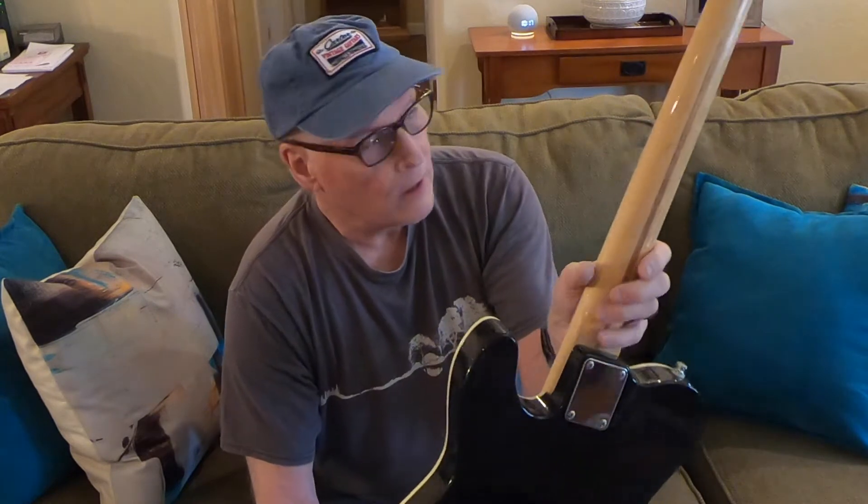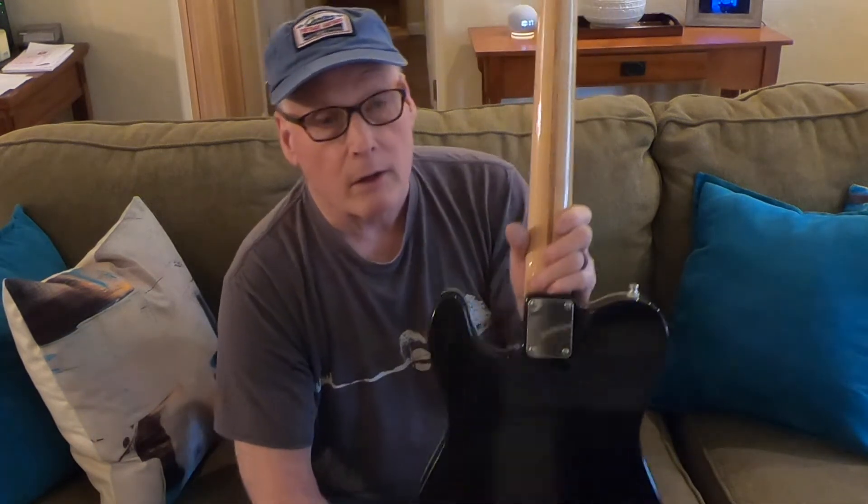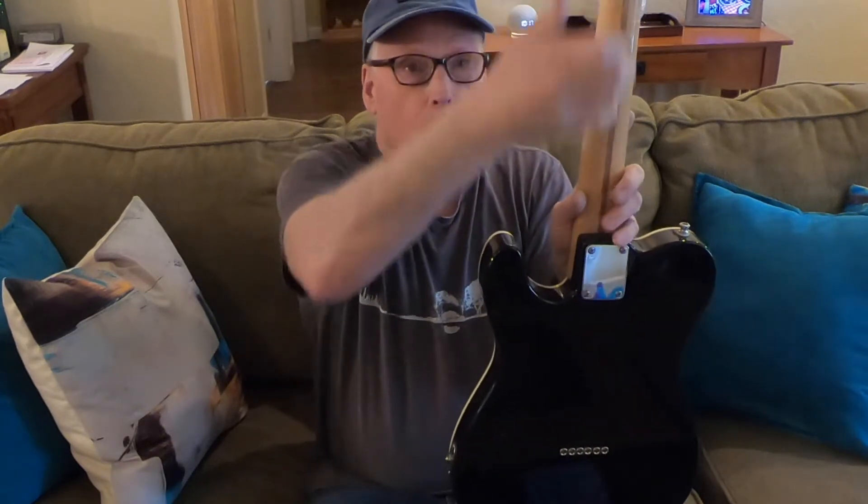I built the neck myself. This is actually the first guitar I built that has the Jonah name on it, and also the first neck I made that I fretted — because we bought a pre-fretted fretboard for that very first guitar. I slotted the neck; it's a true one-piece neck. The truss rod went in through the back — what they call a skunk stripe. I routed that channel, put the truss rod in with a bow using a jig I built, so when you tighten it it actually pulls the neck. Because it went in from the back, it had to have an up-bow in the jig.